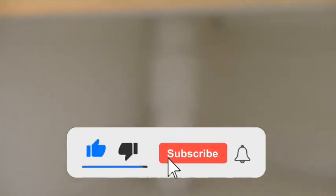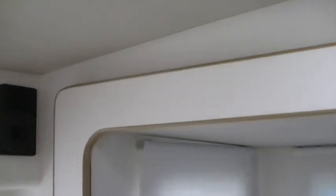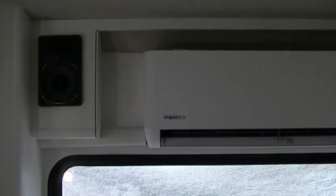In order to go through the cabinet, I don't glue things together — I get everything measured and cut in pieces. There's the coupler, down through that hole, so we have about 32 to 33 inch lengths up through there, then to the 90 and 45. She'll put a TV right here and that'll cover that hole. The cabinetry really dresses it up nice. She's doing a restoration on this trailer — the flooring, walls, cabinets, and different stuff. She's doing a great job and she's doing most of the work.